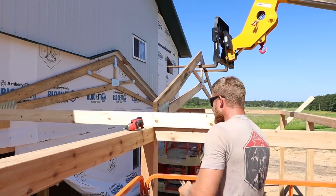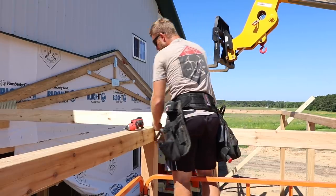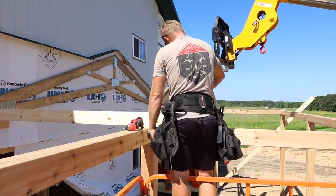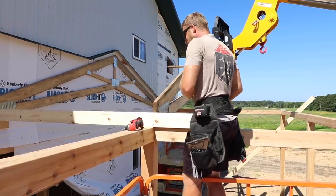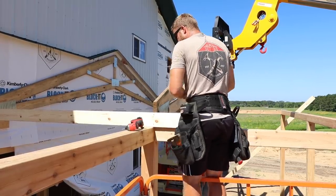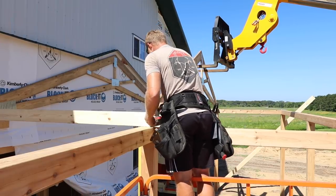But anyway, all right, plumb me up, my brother. Plumb. See what I did here? So this is my rafter tail. We'll run our purlins. This will be a rafter. So we'll sheet our plywood down flush. This will get our fascia to die in perfect. And then we'll make another fascia off of this corner here, and that'll create our valley. Gotcha. Okay, I see what you're doing.